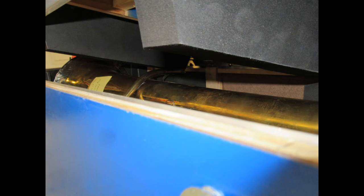It is a good method to initially cut these top blocks a little bit too deep, then do a test fit and see if the case will actually close, and when it will not, then remove the blocks and trim slightly, repeating this until the case almost closes, but a slight pressure is required to close the final fraction of an inch. On this case, the case closes to about 3/16 of an inch, and then slight pressure is required to finish closing the lid, which compresses the top foam block slightly.